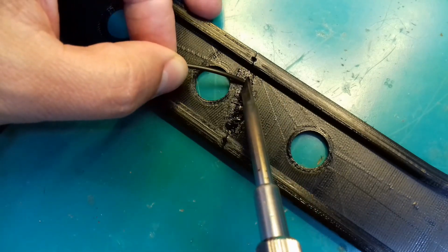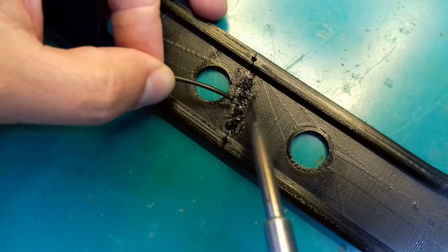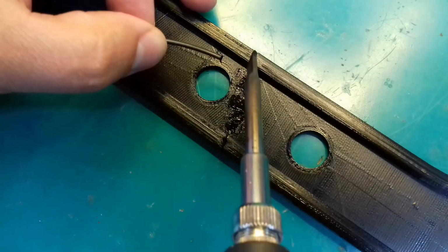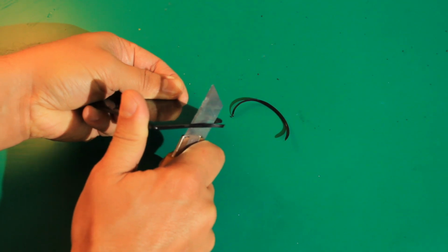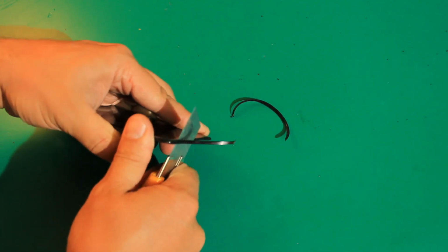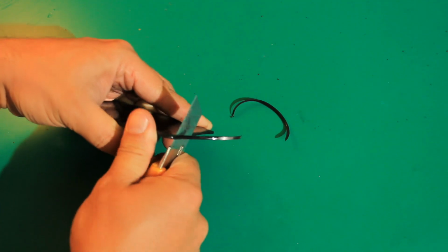The filament usually has to be of the same material you are trying to weld, otherwise the risk is that the part will curl or even crack due to different material characteristics. If you don't have that specific type of material to use as an electrode, you can just slice a strip of material using a cutter and use that strip as an electrode.